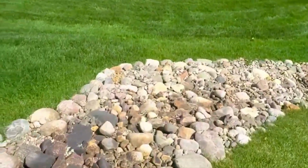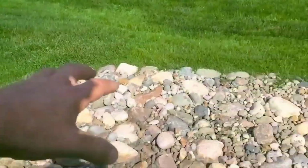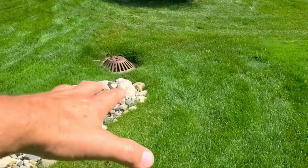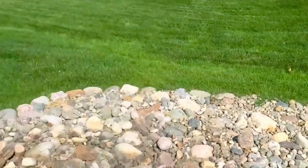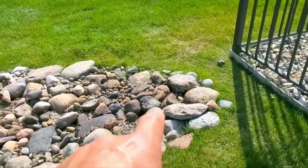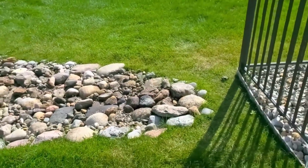Storm drains down there. Now, this was an issue. We were discharging the water up high so that when that storm drain stops taking in water and the water just all gathers here, I actually think that the water backs up in extreme cases on this one. Usually they don't. They just stop taking in water, and then you see a bunch of water. So we have our discharge line up high. I didn't want it to be underwater. It would work underwater, but it works much better when there's no resistance.